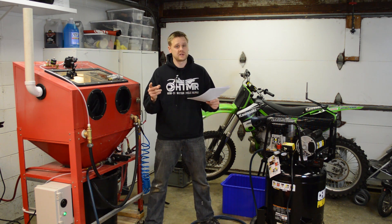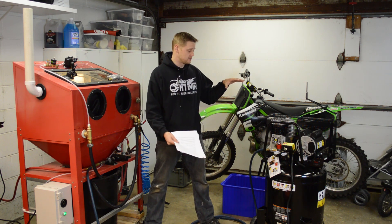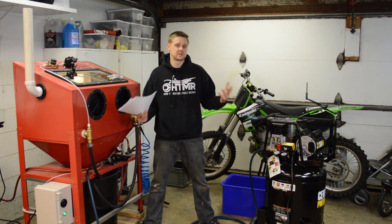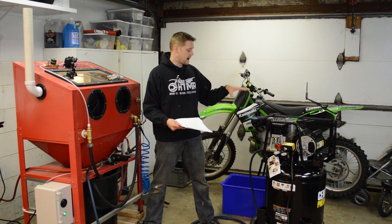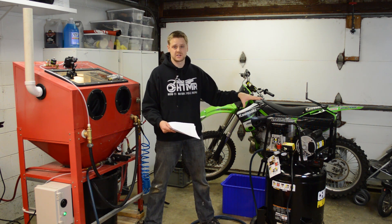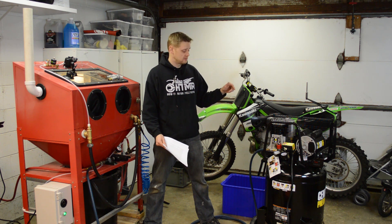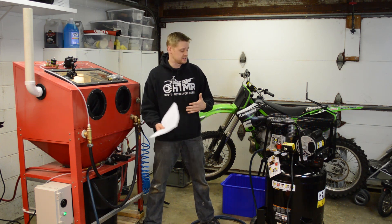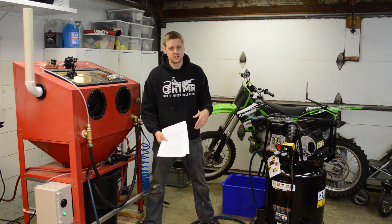After the gun started consuming 6 CFM on my big compressor, that was enough to prove it to me. But for you guys, I wanted to actually buy this compressor and run the vapor blaster with the 6 CFM gun so you can see how it all works and decide if you want to get into this. After this video I already sold it to a coworker since I have no use for it. My thoughts: it's quiet, the price is right, the output is good, and you can vapor blast with it — it's actually a nicer unit than the oil-less Craftsman I had years ago.